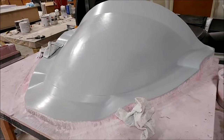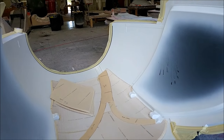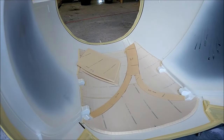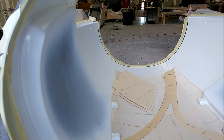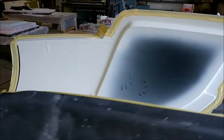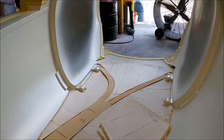The nose compartment door plug was a fairly easy one to move along quickly — really no problems at all. Back to the upper fuselage mold: here are the actual core pieces being dry-fit into place just to make sure they'll sit down nicely. The dual side window pieces are laying in the middle there, and the edges were beveled to 45 degrees using the bandsaw so they taper nicely when the carbon fiber goes over the top.